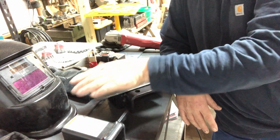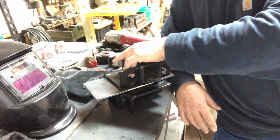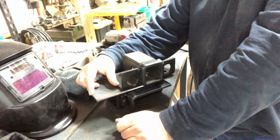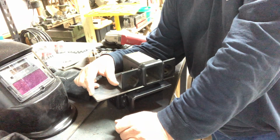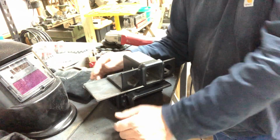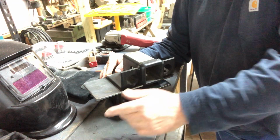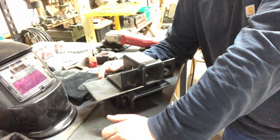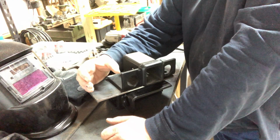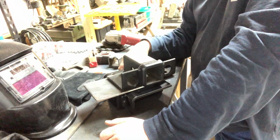I have a 1.5 by 4 here. This would bolt to it on this side. This piece would extend underneath the main supports that go over the sleeper, which is also pretty much the center. If you had to define a center of gravity for this thing, it's pretty well balanced. The center of the weight for the unit is pretty much sitting on top of this plate.